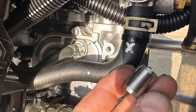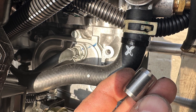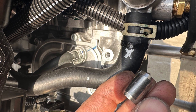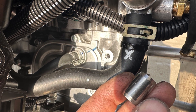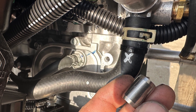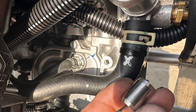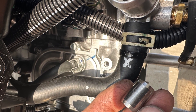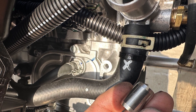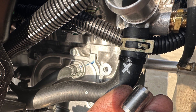If you have an X and a tie-wrap on a hose, it indicates that a stainless steel bullet has been installed in the thermostat bypass hose. We found this in the airplane application helps the thermostat operate more accurately — particularly in winter, it is able to build up to the correct temperature of 180 to 200 degrees and makes the thermostat do its job better.